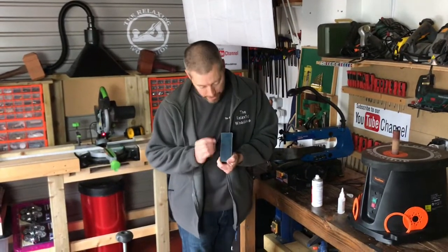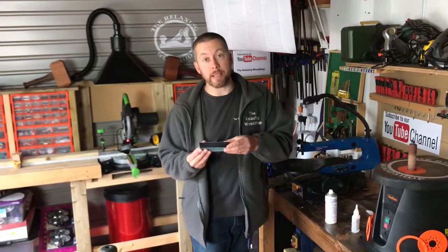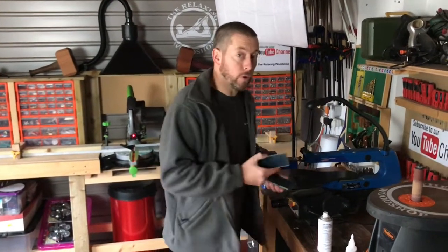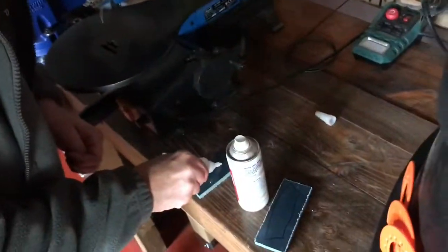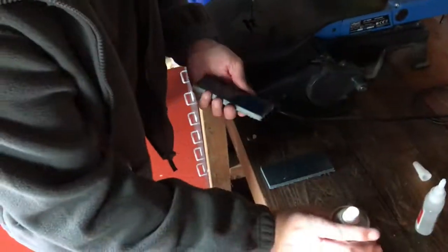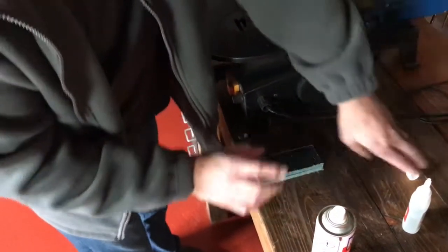What we need to do now is glue these two together so we have consistency on both sides, then draw that design onto the piece of wood, and then get cutting on the scroll saw. Copy the piece of paper design onto the wood. To make these both exactly the same twins, we just need to glue the two together — just the tiniest amount, this is just to hold it together while we put it on the scroll saw. A wee drop here, a bit of activator on this side, and then press them together — that'll do to get it onto the scroll saw.